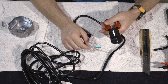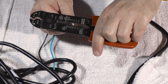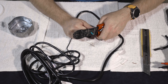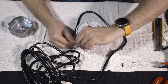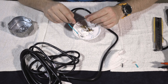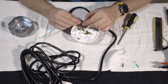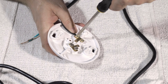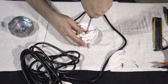The next thing we need to do is take off about three quarters of an inch on each individual wire, strip them, and pull the insulation through. Then we're going to twist these guys. The black wire goes around the brass screw. When you're screwing them down, you want to loop the wire clockwise, because when you tighten the screw it goes clockwise — that makes sure everything goes in the correct direction. Same thing with the white wire: loop it clockwise and screw it down nice and tight.